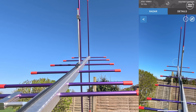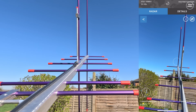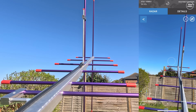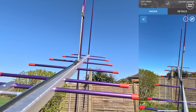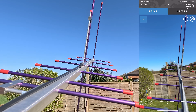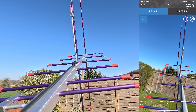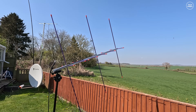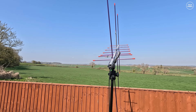Having either a full duplex radio or two radios will be better. When receiving, you can maneuver the antenna for reception, but as soon as you press transmit you can't be 100% sure you're pointing in the right direction. Having a second radio listening to the downlink frequency while you're transmitting gives you that edge — you'll hear yourself coming back from the satellite via the downlink if you're aimed correctly. I also have another radio which can perform automatic Doppler shift.